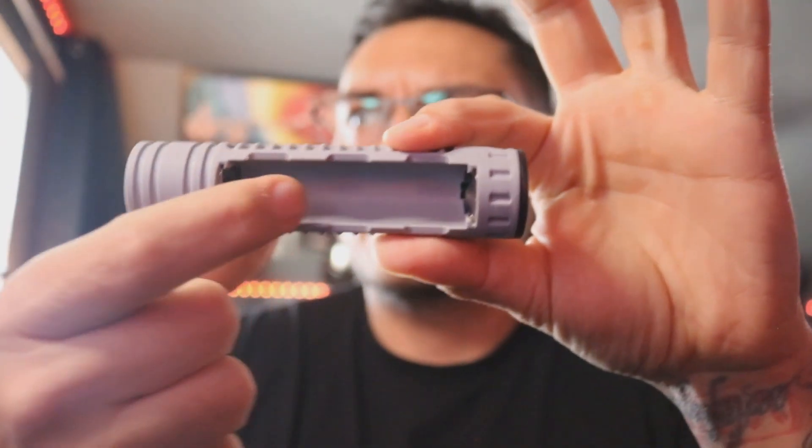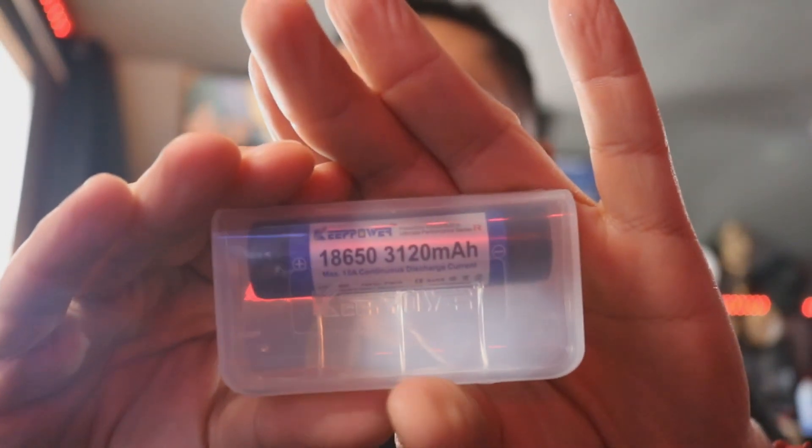You've got a removable battery setup here, so please remember spring side is negative. Now you are in Germany, so I won't be sending a battery with the saber. It takes an 18650 Keep Power battery — I have one right here and it looks like this. That's the type of battery you need. It doesn't necessarily have to be Keep Power; these are always what I recommend. The important thing is it's a protected cell. You'll see a lot of 18650 batteries out there that aren't protected, and when they're not protected, they're not as long as this. The chassis was made for this length of battery, so it needs to be protected, and it's always just way safer to use a protected cell battery in your saber. So remember that — if you need to rewind this demo, there's a picture and an explanation for the battery that you'll need.